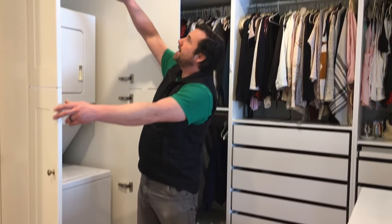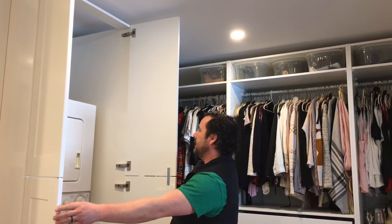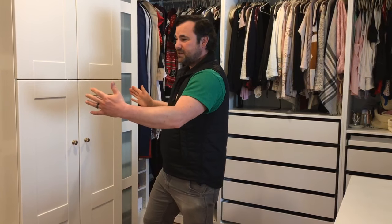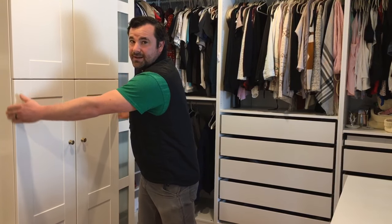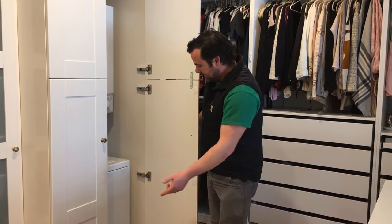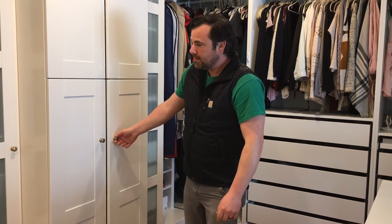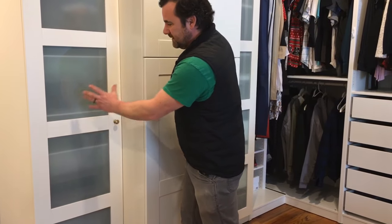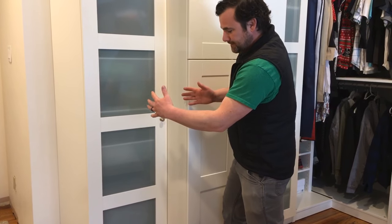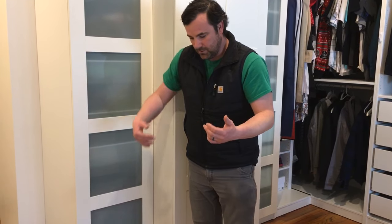I have a backing there, and also a backing at the very top, so my doors sit nicely and don't fall inward. It also gives me that true 30 inch dimension, because the 30 inches is outside to outside — the exact same as a cabinet box would be. To help hold that gable panel, there's another PAX unit — 50 centimeter — that just gives me stability, set back so it doesn't crowd the room and around the corner from the door.